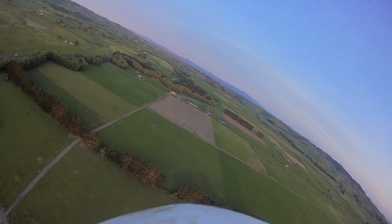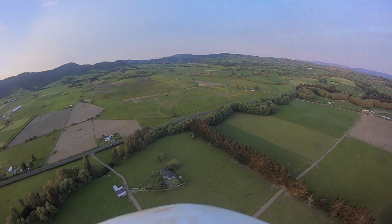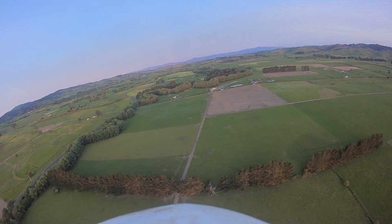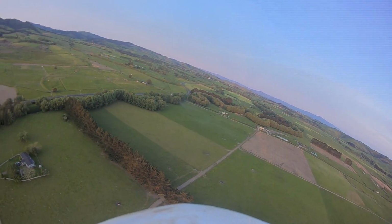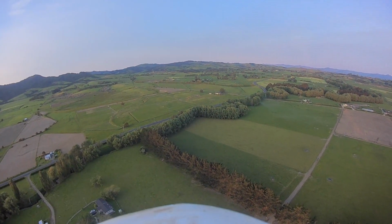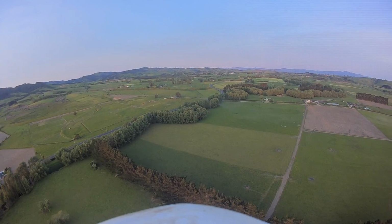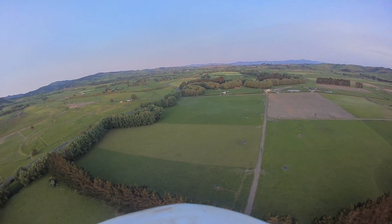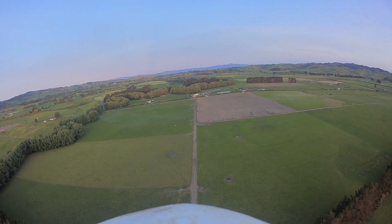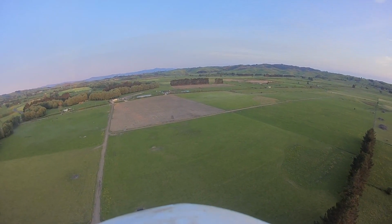Just sort of glides, I mean it rolls further and further to one side, which is not good at all. I wonder why. I guess the accelerometer is not feeling true gravity when it's riding on the plane like this, eh? That might have something to do with it. Maybe it should be paying more attention to the gyro than to the accelerometer. Still, this is pretty good. Hands off here. At times it can hold this level for a long way.